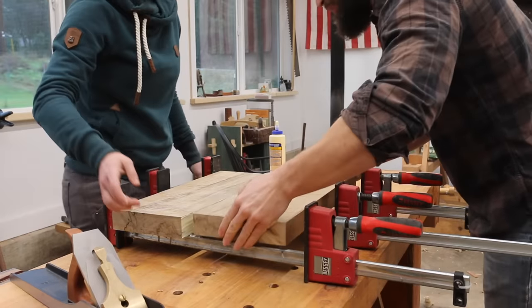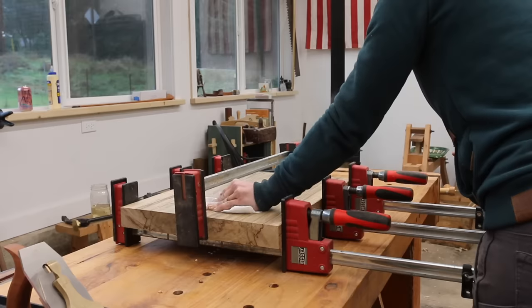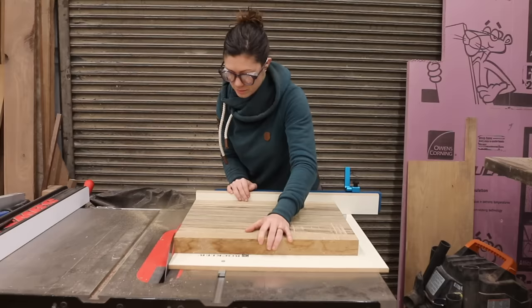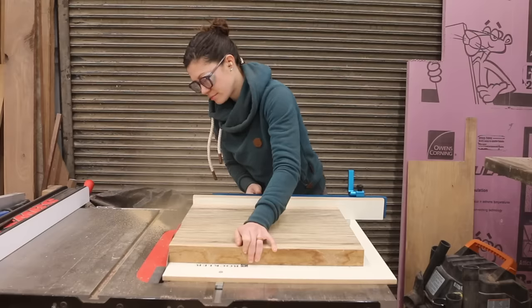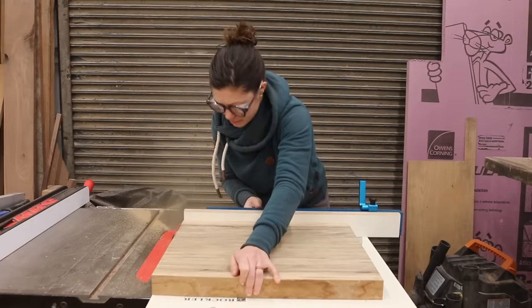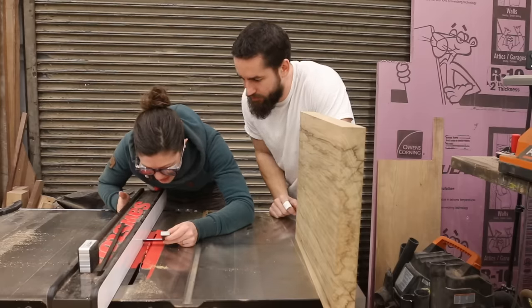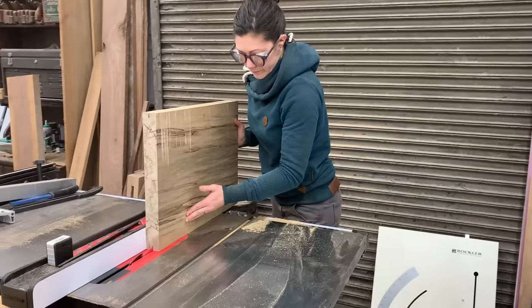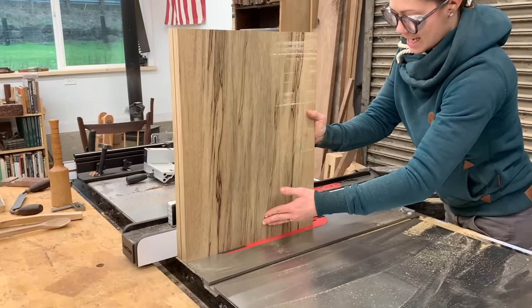The original plan was to glue up and resaw a piece of black Limba to create two bookmatched round pieces for the sculpted table. It's incredible, you can't even see the seam. We pulled down a slab, cut it up, and prepped it for the first glue-up, and then I used the table saw to cut dead center on the new piece and establish a starter kerf around all four sides to act as a guide for the frame saw as we resawed it.